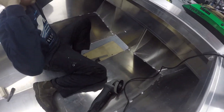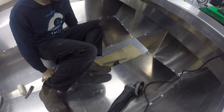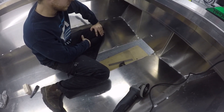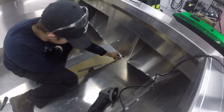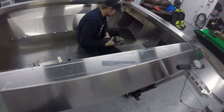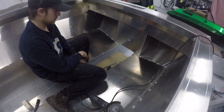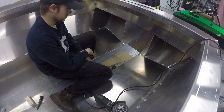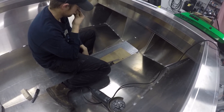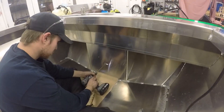So we're just cutting the hole in the floor for the intake to go. On the new Gen 2 kits, the quarter inch is already done in plasma, so you just have to cut the little supports and then it drops out. Then we just measure the transom based on the thickness of the intake plate. We use a piece of wood underneath, lift it up with the jack to keep it flush with the bottom of the boat, and then hopefully the intake sets right in and we can tack it in place.